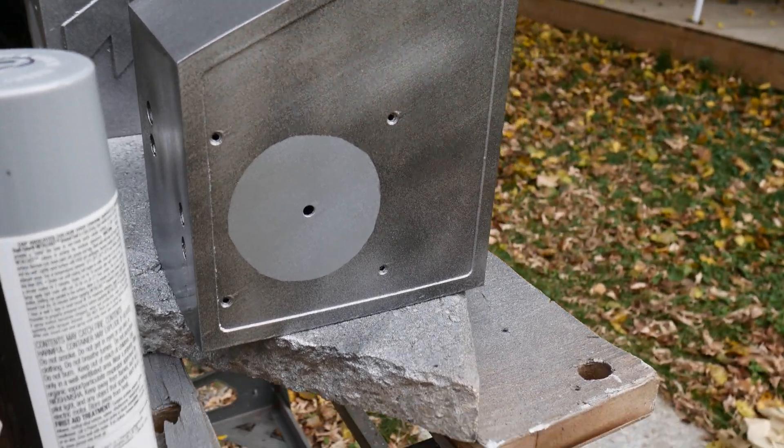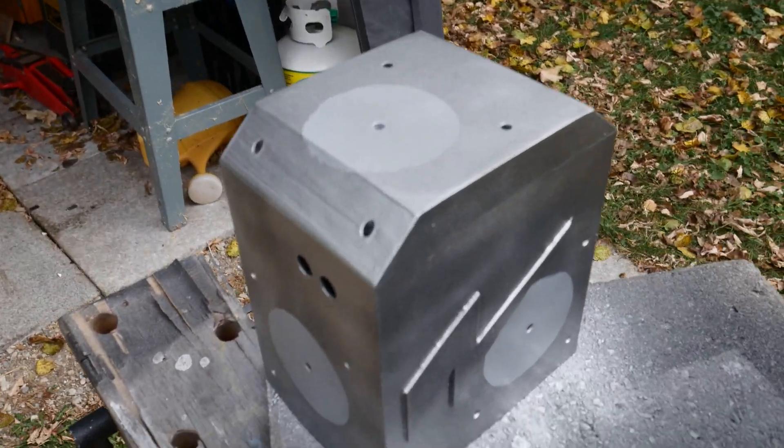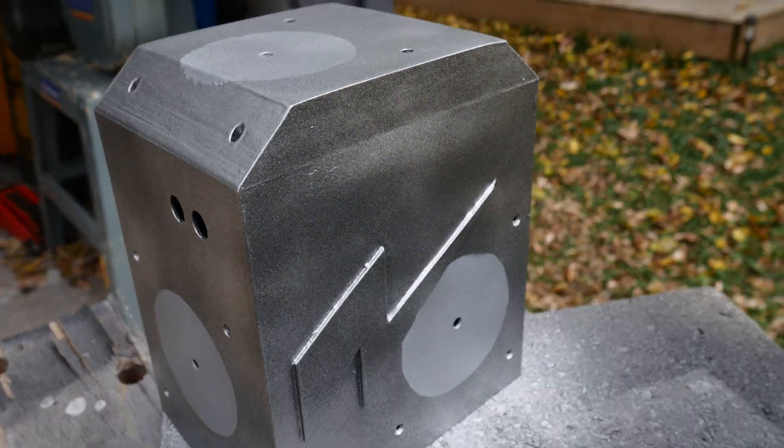On screen now is a reference that I used to paint the hammer. They were all numbered so I could recall which one I needed for what part. My painting process involves spraying one coat, then waiting 50 minutes, then spraying another coat, and then letting it cure for a full day. A common mistake is trying to rush through the paint job by painting too much in one go or by painting too often. Don't do this — it's going to leave cracking, and you're going to have to start over. It's going to take you a day to sand everything down, another day to prime everything, another day to paint your metal coats. You're wasting five times as much time as just waiting.